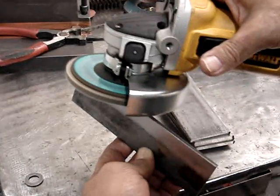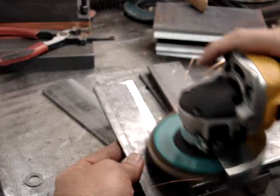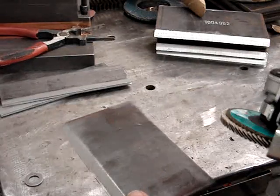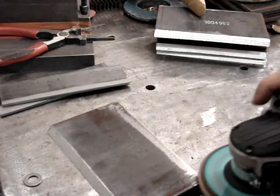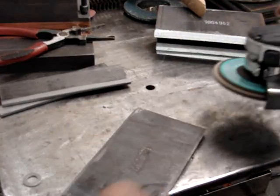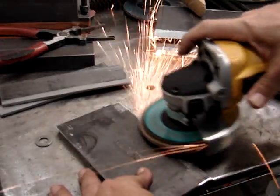This is how to get some decent practice just using flat bar. What's better is if you can get some plate and put a bevel on it — the exact bevel and joint configuration that the welding test is going to be. That's the next best thing. It's not as good as actually welding pipe, but the same amperage settings and techniques are used.